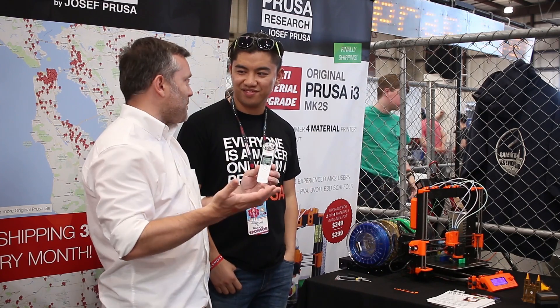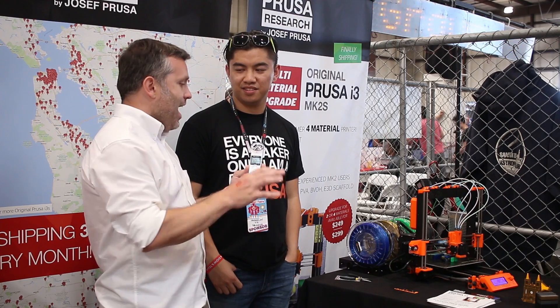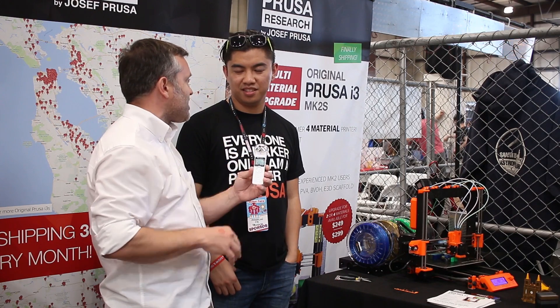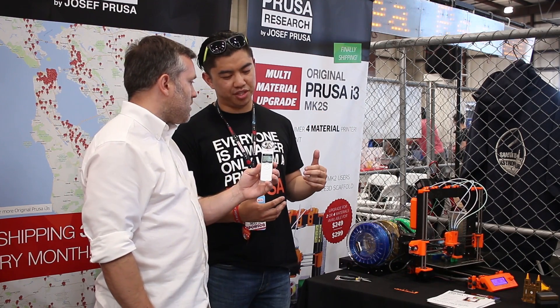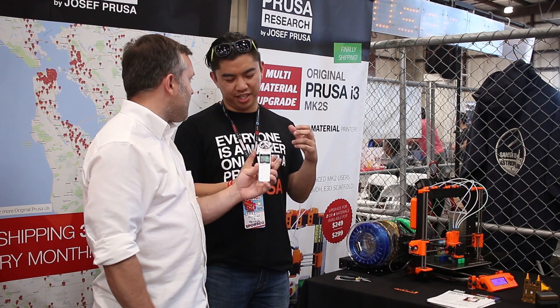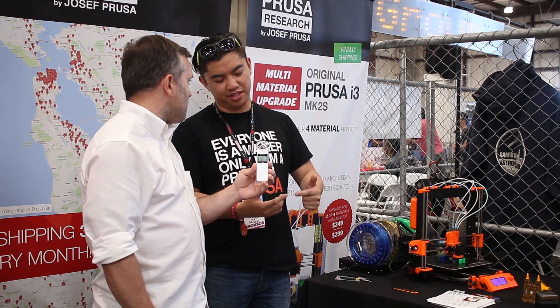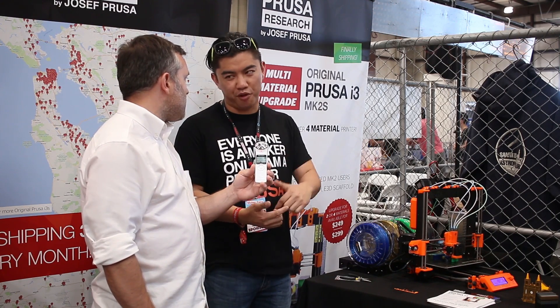I have a little experience, as people on my YouTube channel know, with trying to print with three colors, and I get those strings that sort of jam everything up. With that custom heat break, you guys are able to address that problem, right? Well, it's more about optimized internal geometry to prevent plugging. Because as you're exchanging different filaments, once the end comes into the barrel, it kind of deforms a little bit. So you need to make sure that the inside is perfect so that you can pull it out every single time without any jams.